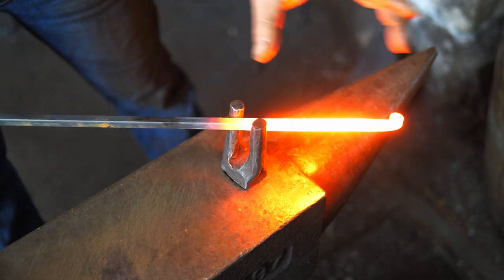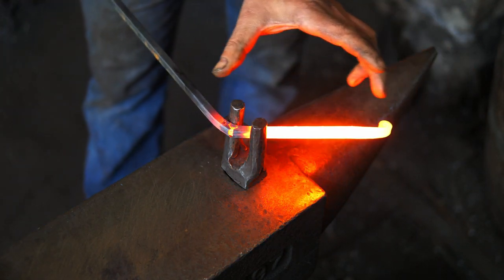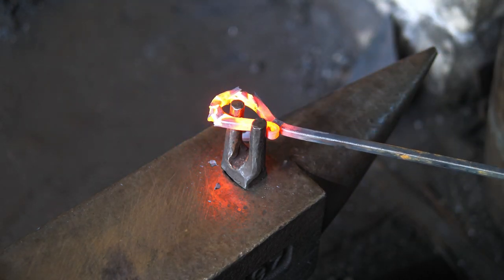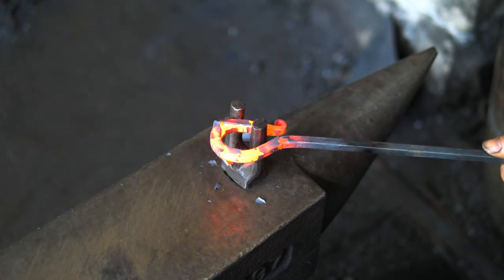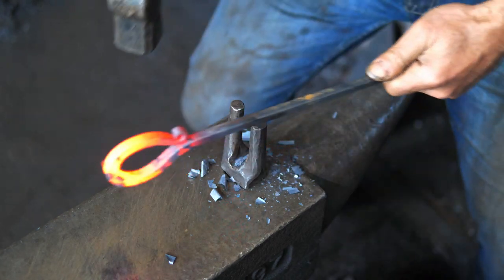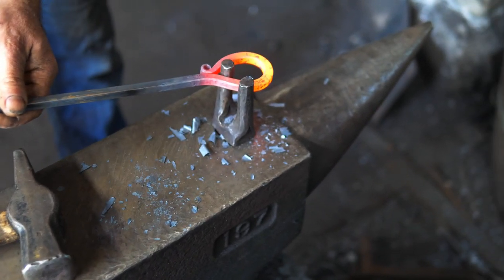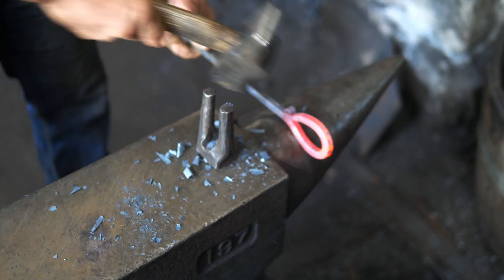The key to this step is getting a consistent heat about seven inches long, as even as you can make it. Then at about seven inches I'm going to do a 45-degree bend in the forks, then flip it in the forks and just walk it around the horn, bring it around, and you end up with your shepherd's crook. Then adjust it in the forks until you get it centered and you're pleased with the aesthetics of the overall shape.